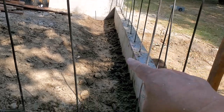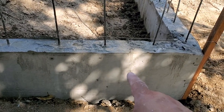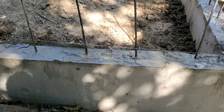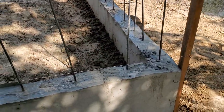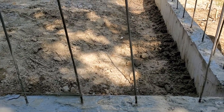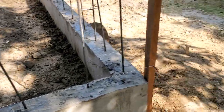So this is a retaining wall. I'm going to bend the rebar over, connect them to the other side, and pour a nice four-inch concrete slab. The concrete is a little bit thick — not too thin — but very manageable, and this is the way it should be. Now, this gentleman here, his name is C.D. He and the crew around here actually live in the neighborhood. He's only 22 years old and he worked in Manila before, so some of the standards he has are from building construction there. I really like that.